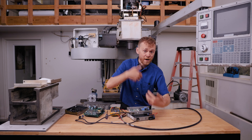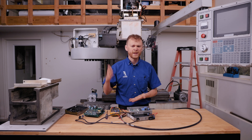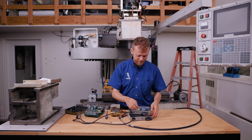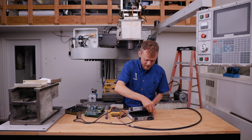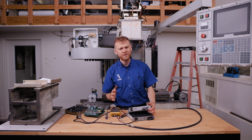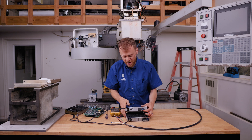So we talked about swapping — that's only if you can reset the alarm and the alarm is intermittent. If you're getting the alarm immediately on power up, you've got to go to the back of the machine. The amplifiers run on high voltage — between 300 and 350, 360 volts DC. It's what they call daisy chain parallel across the box.